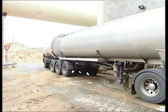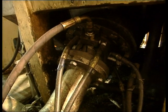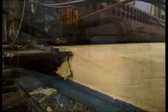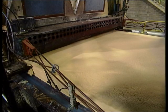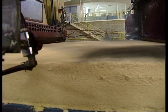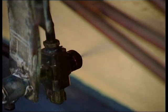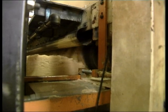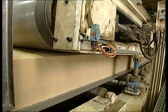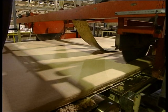The glue is urea formaldehyde and is brought in by the tanker load. The glue is added to the chips and they swirl along the pipe, which helps them bond together. The fibres of wood pulp are laid in a mat. A blue spray indicates that this particular glue is water-resistant, so it can be used on floors that may get wet during building. The edges are trimmed and the mat is compressed between plates to the desired thickness and density. A metal detector causes the line to dump any section containing metal, to prevent injury later in woodworking.